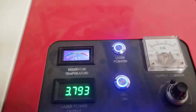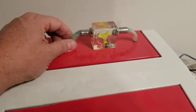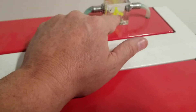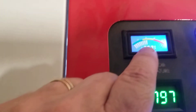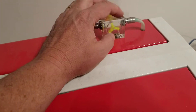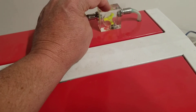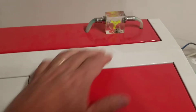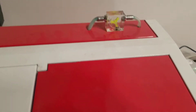What you will use, and I think this is extremely important, is this little gadget here. I went ahead and purchased this and ran the actual water lines through it, so as the laser turns on I can see that my water is actually running. This gauge also helps me maintain and see the temperature. Those two are important — I never really knew if my water pump was running when my laser was on, and this gives me a visual indication.